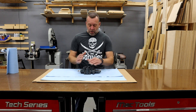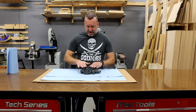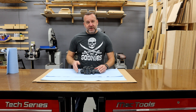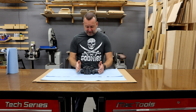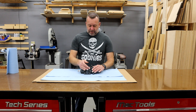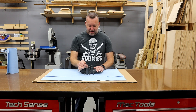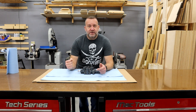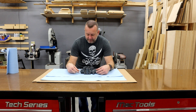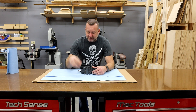So why is leak down normal? Well, I have here in front of me a loader valve. This is a valve body — it has the inlet and outlet ports here. And then these are the two spools. These are what are moved in and out, actuated with the loader stick. We're going to completely ignore the fact that hydraulic fluid leaves this, goes back to the tank, power beyond and all that. We're just going to imagine that the hydraulic fluid is coming in here and stops as being pressurized. When you actuate your loader lever, you are moving one of these spools. And these spools are a round metal piece of steel that is precision ground to fit inside this valve body.